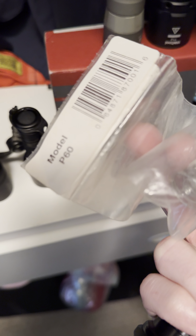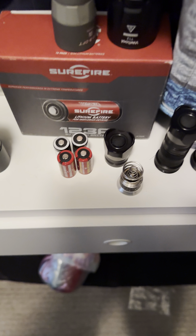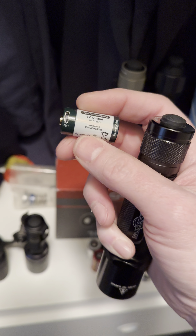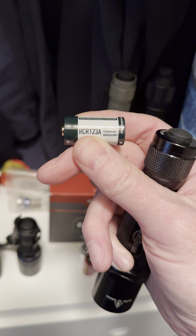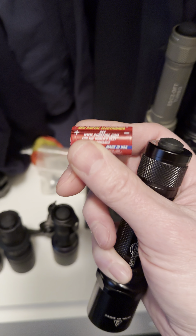I finally picked up some original SureFire model P60 bulbs in order to test whether or not these KeepPower batteries will actually not burn out the bulb in a P6. So these are the 3-volt mini USB-C rechargeable CR123As, and unlike most rechargeables, they're only 3 volts, which is exactly the same as the regular lithium batteries that come with it.